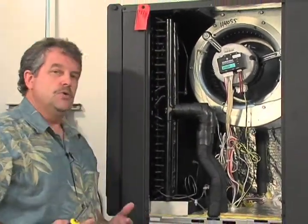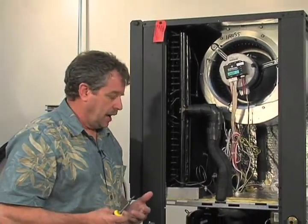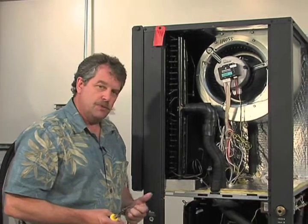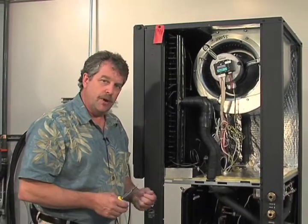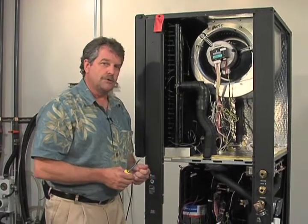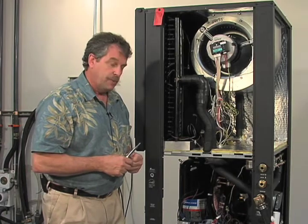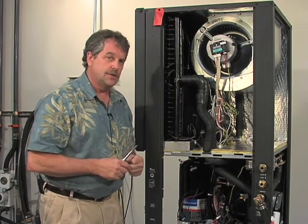While patiently doing this process, again, don't rush it. Make sure you've got all the air out. You want to be cautious that you're not dripping or spraying water on the circuit board. Remember, you have to move the wire back and forth with this valve, which means your control box is open and susceptible to moisture if you actually spray water in the wrong direction. So consider that.